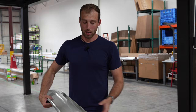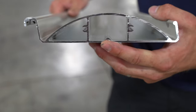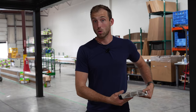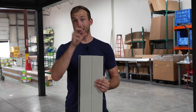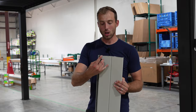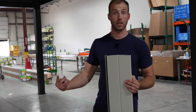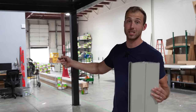That no-spill edge was something my father and I designed into the louver after hearing complaints about other products. In the middle you'll see it's a hollow extrusion with a V-groove on the bottom. The hollow extrusion minimizes heat radiation — the top heats up while the bottom stays cool beneath you. The V-groove is mainly aesthetic: this is an 8-inch louver, and without it you'd have 8-inch sections of framing above your head that look too wide. The V-groove breaks that up so when the unit is closed it looks more like traditional car siding or tongue-and-groove ceiling in terms of dimension. The louver is also flat in profile so it looks like an actual traditional ceiling when the unit is closed.